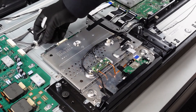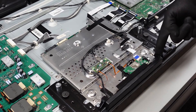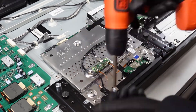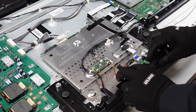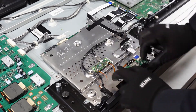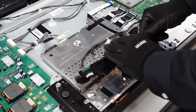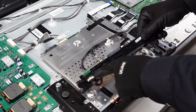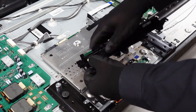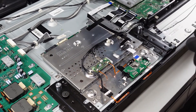There we go — that's the easiest part of this T-con board. Next, this frame right here: you're going to notice a screw right here and right here — remove those. With those removed, you'll notice this cable is connected to this framing piece. Lift straight up and gently flip it over, and you'll have complete access to this plug. Just pinch on that clip and pull it out gently — pull that right out. We have these two separated; sit that off to the side.